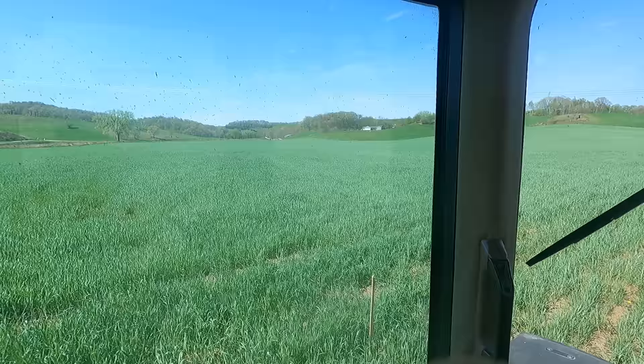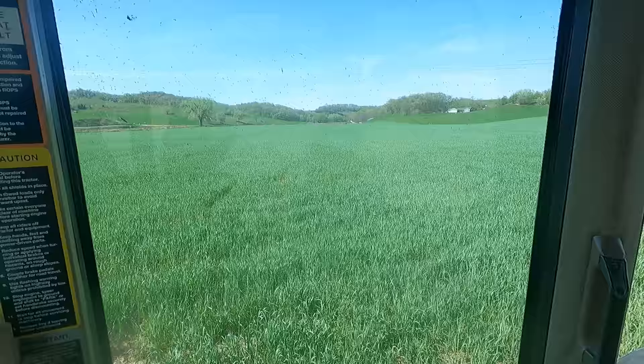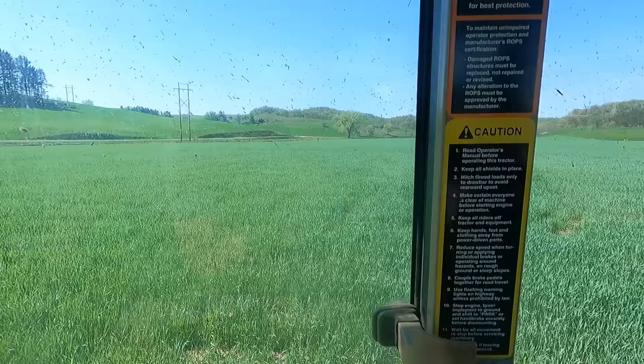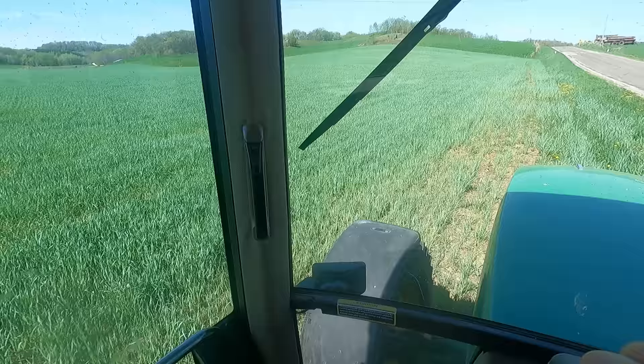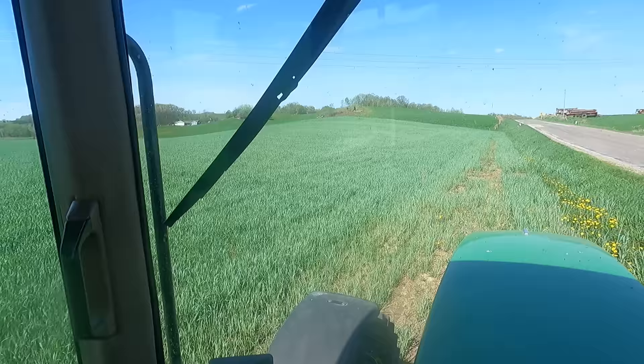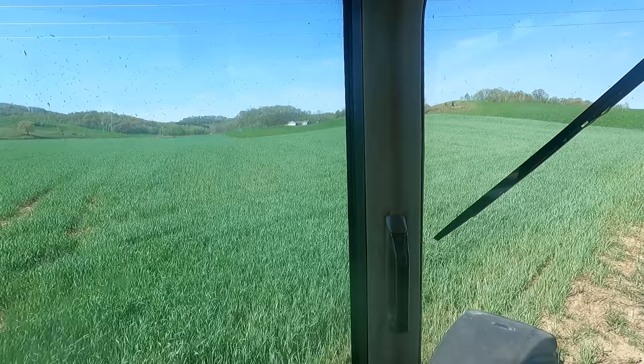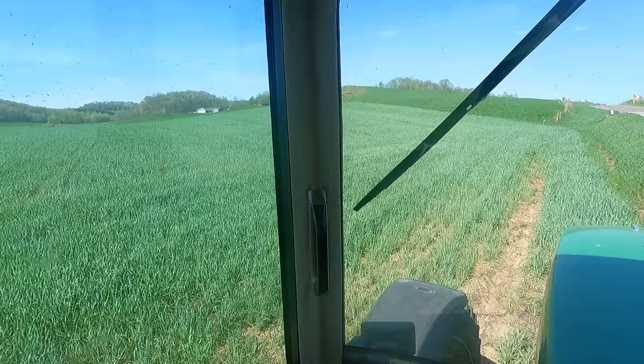It's kind of hard to tell now with the rye as tall as it is where the furrow used to be from last time I moldboarded, which was several years ago. Looks like about right here — this little sign might be about the middle. This field is almost perfectly rectangular, so that's going to make it a little easier. I don't know how I'm going to do the ends yet because then it ends up with another furrow there. Sometimes I can follow the old corn rows, which keeps you nice and straight so when you come to the end of the field you've got your bed furrow all together and you don't have a bunch of short rows to fill in.